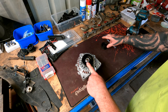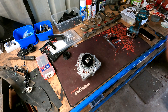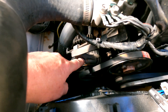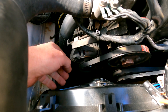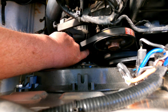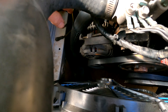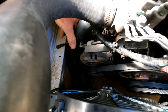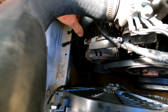Now that's done, I'll get all this together and get it over to the car — time to install. The next step is to get the alternator off, so I need to loosen up the tensioner. Once that's done I can slide the belt out of the way, and then right down the bottom there is another bolt that needs to be loosened off. I'm hoping I can do all that without having to drop that hose.